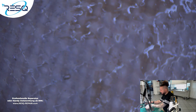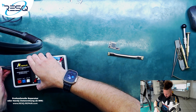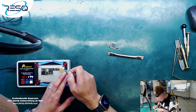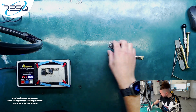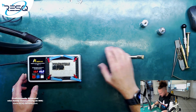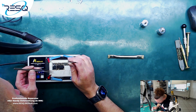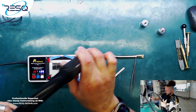Go to the preheater again, disconnect the thermal camera, take the preheater, go to the top. Put the board on, take some flux, apply it all over. Take the top layer board, place it on, and just wait a short time until the solder melts again. Then use some hot air to speed up the process.